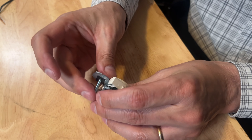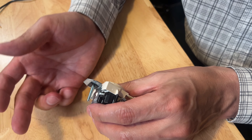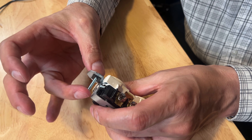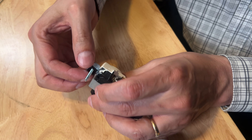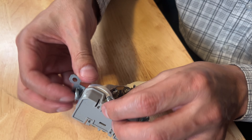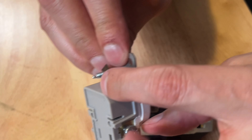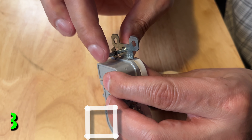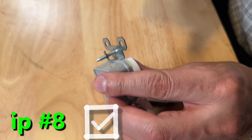Or if you need longer ones, just back them out and go to the home improvement store and buy machine screws 6-32 of an inch — they will work fine in all your electrical boxes. The only advantage of these factory built ones is they have a bullnose end to them, so it makes it easier to find the hole in the box. But any 6-32 machine screw will work.